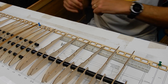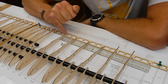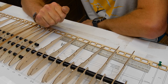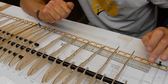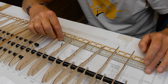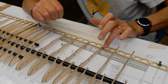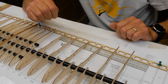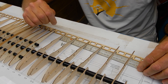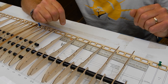Little top tip — I've jigged this up. When you have to notch the ribs in it's always a nightmare because you get one that sticks and the wing won't move. So I've got a steel ruler that I put in place before the ribs, which lifts them up and stops them engaging prematurely. Then I can slowly lower the wing as I slowly pull the steel ruler out, engaging into the notches. Bosh — saves a little bit of frustration.